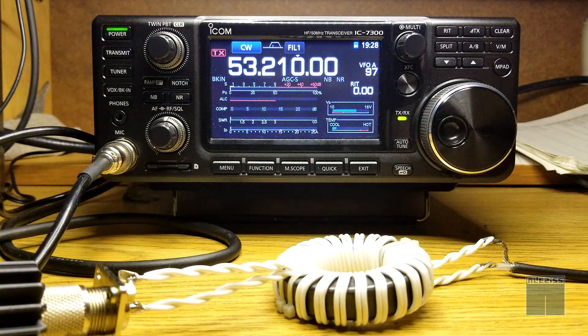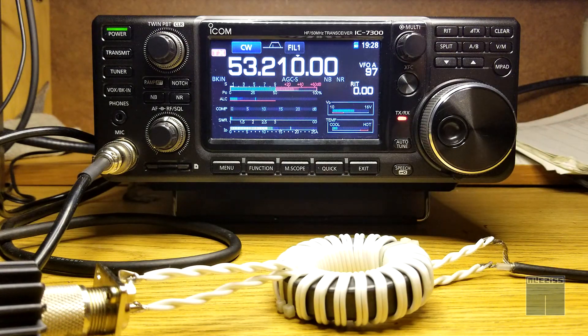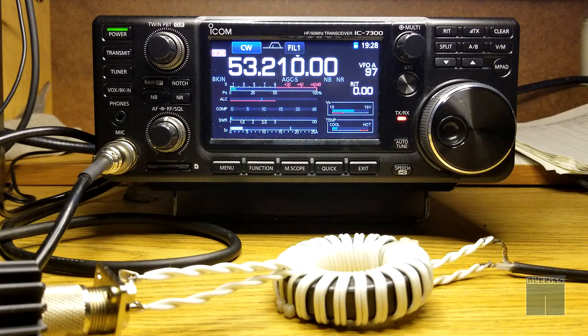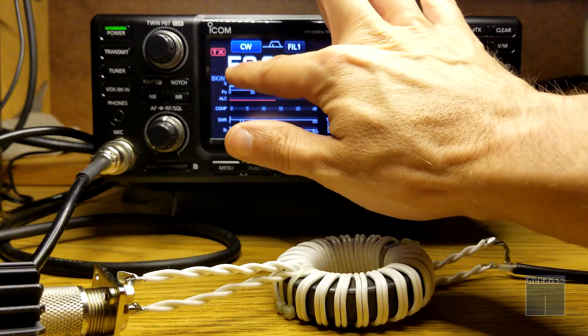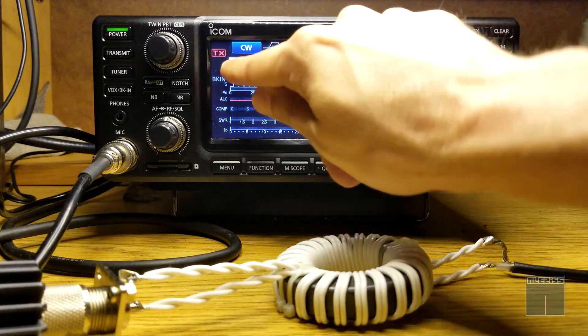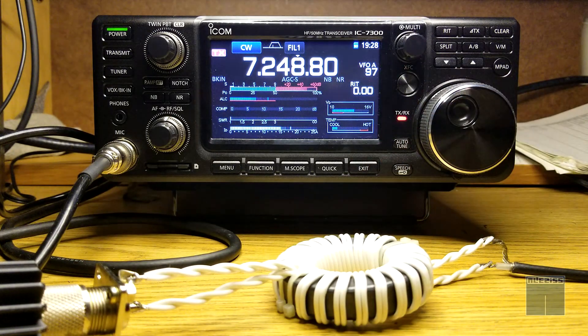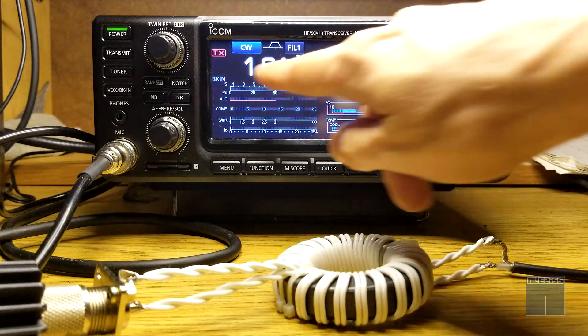I see a little bit of movement, so now I'm moving to full power — 100 watts — just for a couple of seconds to see. This is full power: you can see 18, maybe 18 and a half amps of current draw. A tiny tiny bit of SWR, just one bar lighting up on 50 megahertz. Let's try 40 meter at full power — nice. Yeah, full power on 40 meter. Let's go 160. Cool. 10 meter — nice.